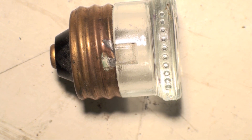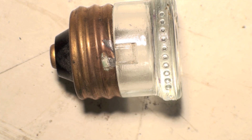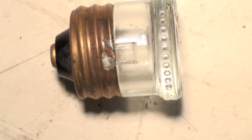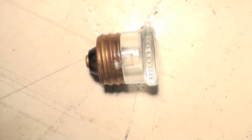If you have this type of fuse, the circuit may have been set up for 15 or possibly even 10 amps, but I can put a 30-amp fuse in and they'll all fit. So I could end up with a fire because I do not have proper circuit protection for the wiring size I have. That's the old simple fuse. There's a lot more fuse stuff coming because there's a lot to circuit protection.